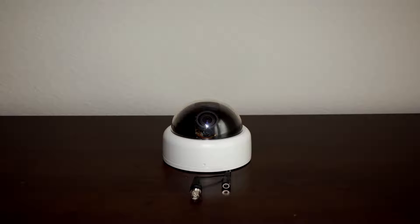This first camera is known as a dome camera, easily identifiable by its clear polycarbonate cover, which helps protect the lens and internals from outdoor elements such as weather, extreme temperatures, dust and dirt, insects, and even light damage from someone intentionally trying to damage the camera. Some drawbacks of a dome camera, however, are that because of this clear lens and weather-sealed cover, it's not as easy to adjust. You'd have to remove the dome anytime you want to change the viewing angle or access the internals.